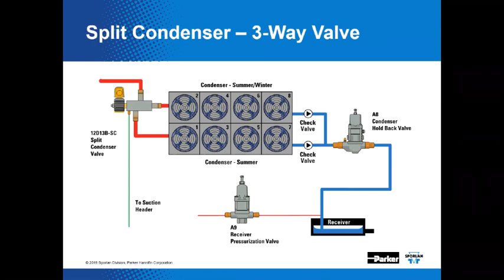There's no stamping with SC on there. Okay. On that one. But there's nothing that indicates on the body that it's a heat reclaim valve. That's correct. So you're going to rely on the nameplate on top of the coil being affixed. That's right. And there's no stamping SC on the heat reclaim valve. Okay, so there's no SC on the heat reclaim valve, but there's no HR.